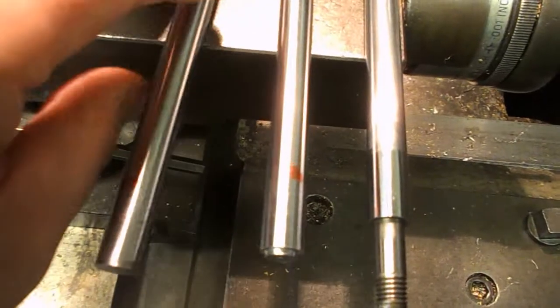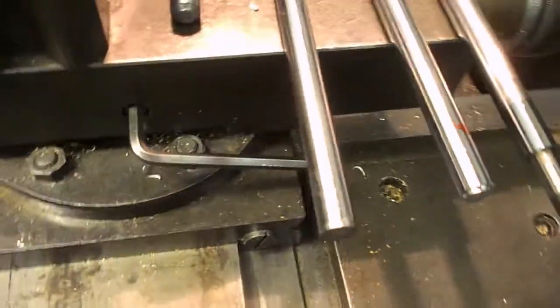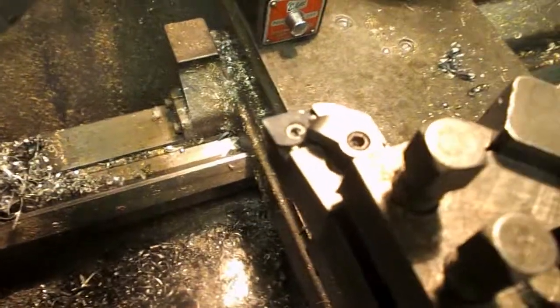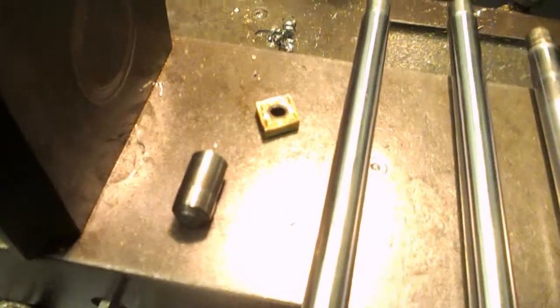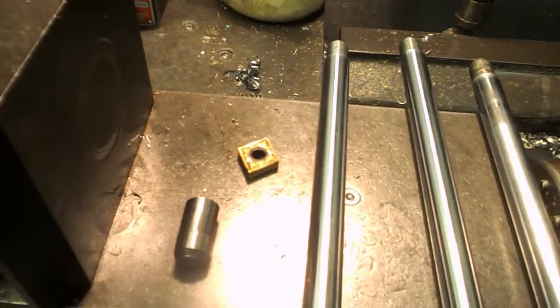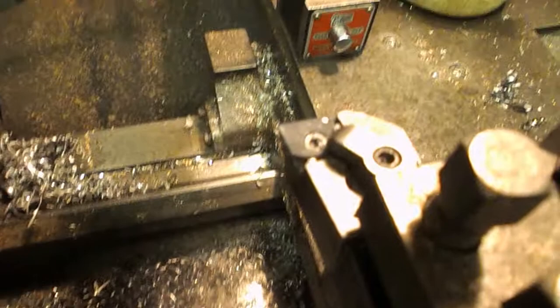But the plan was to just - well it's still the plan - is to get a ceramic turning tip, which we have in the tool holder here. That one there is the one I took out of the tool holder. So we've used these before, the ceramic tips, and they will turn away the case hardening skin.